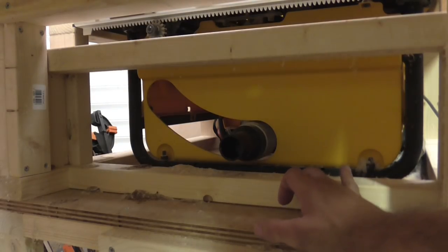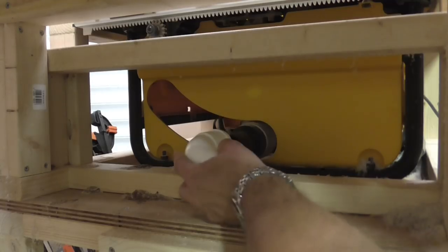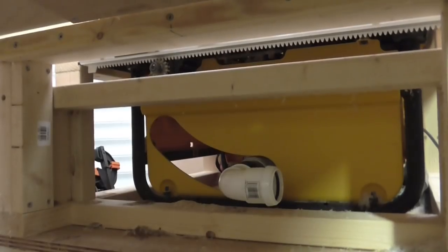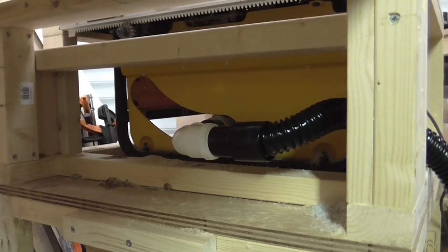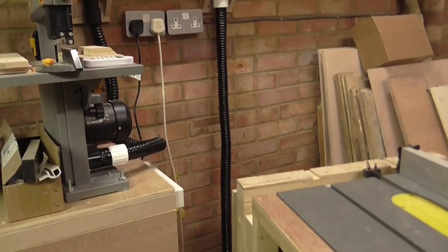The table saw outlet was about 75mm. I've put a reducer on that I had with a kit of hose that's reduced it down to about 40mm — it now accepts one of the push fit fittings. I'm putting a right angle fitting on it so I can run the hose from the side as opposed to the front, because I've got a folding out-feed above it that might interfere. I've got a nozzle that fits the 38mm pool hose that fits straight in there. As you can see, the hose runs round and out the side. I'm putting a generous amount of hose on this as well because when I'm cutting big sheets I tend to move the table saw away from the wall. So that's the table saw connected up to the blast gate.